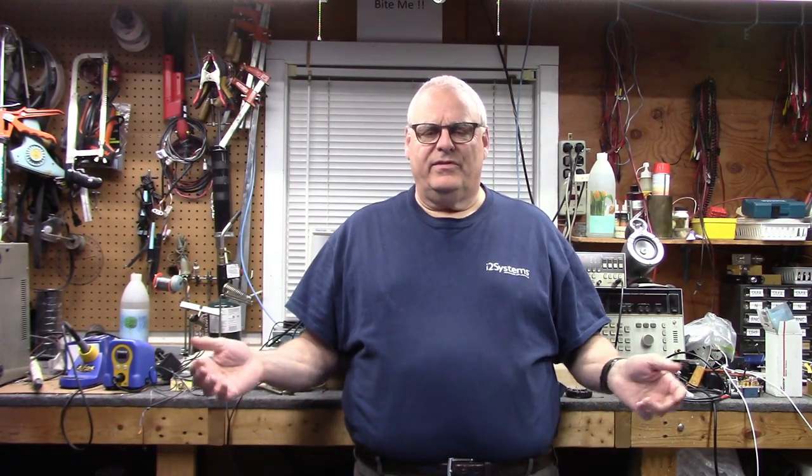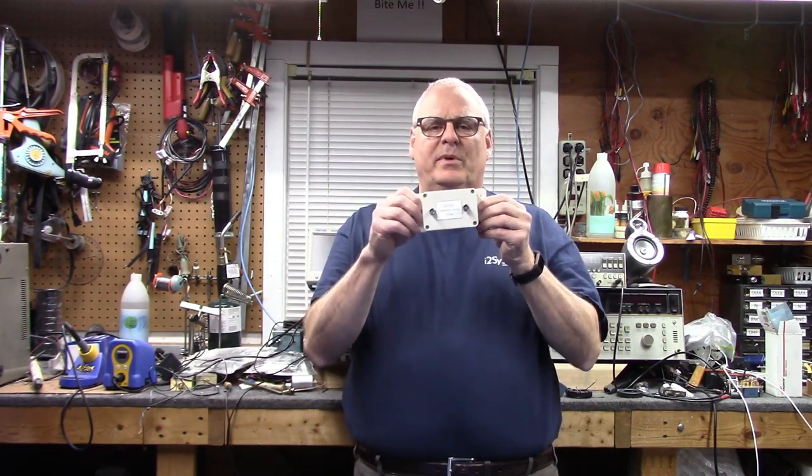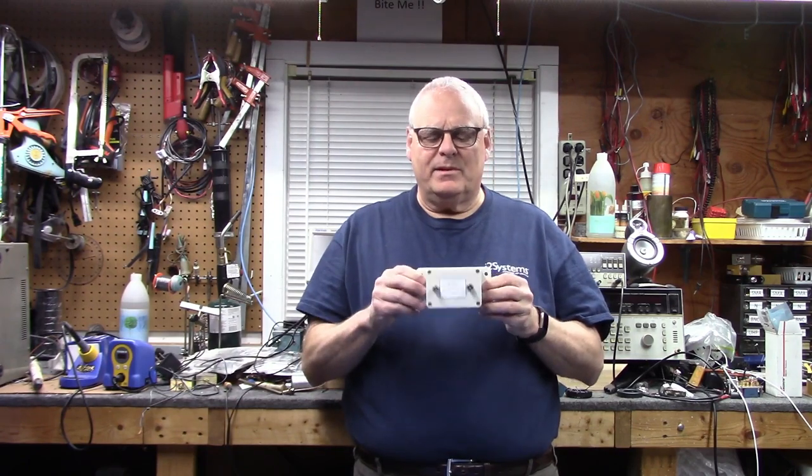So one of the things you do is you remote your antenna. I'll show you a little clip of my e-probe out in the woods. It's 350 feet out in the woods, but you still have a problem — the noise that's conducted onto the transmission line getting out to your antenna. That's where this little baby comes in handy: the common mode choke.